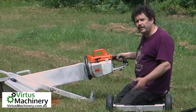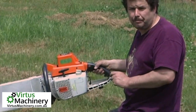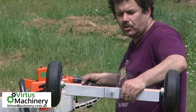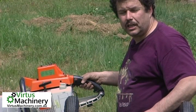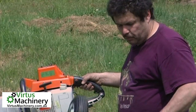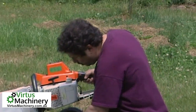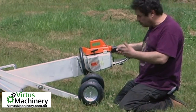Now, you'll notice for the transport wheel set that goes on either leg, when we're moving the machine, like if we're going to pick our machine up out of a vehicle and move it to wherever the stump site is, the axles of the stump grinder are offset to one side. Let's say I want to move this machine, in this case with the aluminum leg on it, somewhere a long distance so I'm not packing the machine. I'm going to put those axles towards me. I'm just going to slide it on this bottom part of the leg. The axles are going to be back towards me.